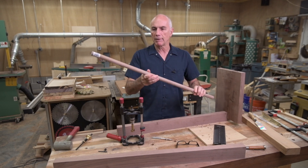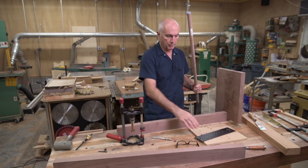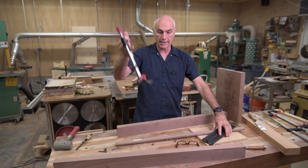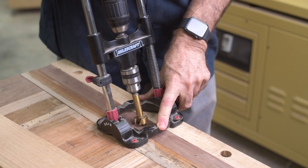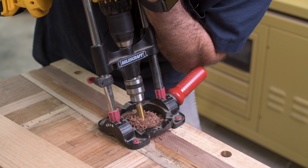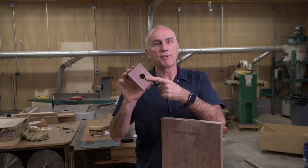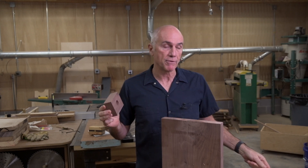This morning I ran to the woodcraft and got myself a one inch dowel. I laid it up against the horizontal piece with my angle finder and it looks like 15 degrees — looks pretty good. So I'm going to go with that. I've got this little jig set to 15 degrees. I need to mount this in my end vise so it's nice and flush because this requires a nice flat surface. While I had the jig set up, I drilled a block at the same 15 degree angle, and this will mount to the bottom side of the slab and receive the one inch dowel.